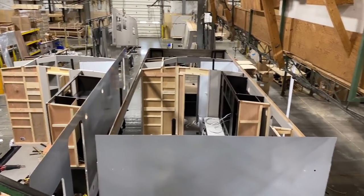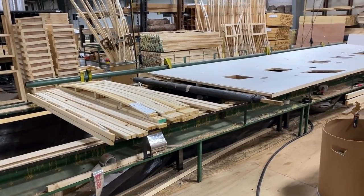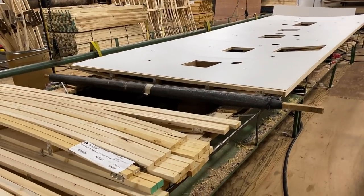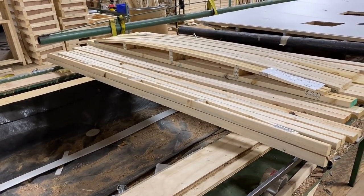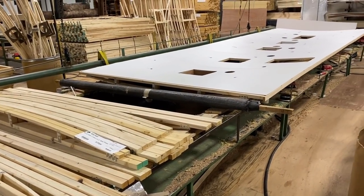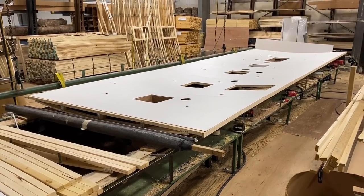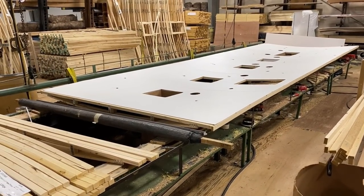After the walls go up, very quickly you see the whole thing develop. At a second loft location, you have the roof shop. This is the only other significant area where Whitehawks and Jayfeathers vary — they both have a constructed roof. That's where Jayco uses their Magnum Truss Roof System, which has the heaviest roof load rating of anybody else in this class, with plywood decking. No one else in this class has ever claimed they hold more weight than this — rated at 4,200 to 4,800 pounds.